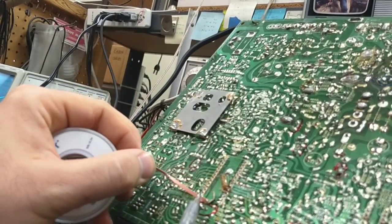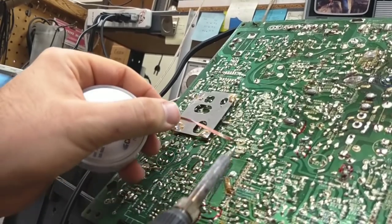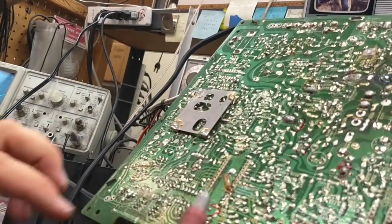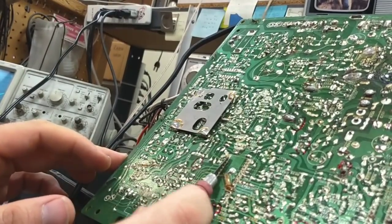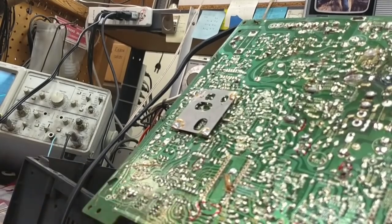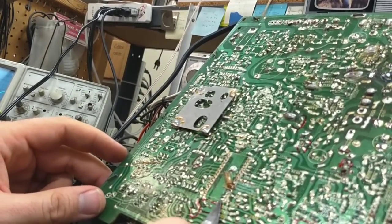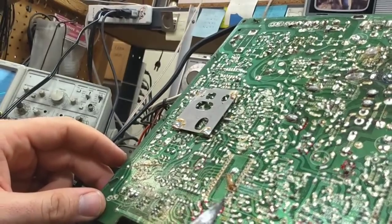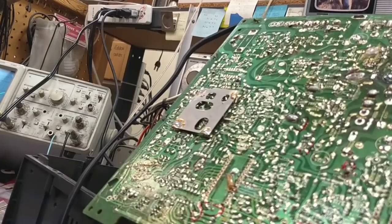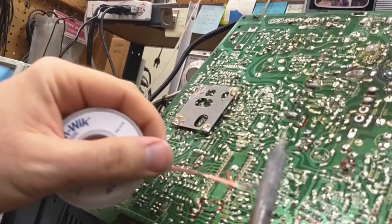I would love to have something like ChipQuick for an IC like this, but I'd be making a huge investment for probably two or three uses at most. Now that we've got the majority of them desoldered, I'm just going to take an X-Acto and peel up the terminals — kind of make sure they're free-moving in their holes. I've got this one here which is going to be a problem because it's got that thing attached to it, five up from the bottom. I've got to remember that.